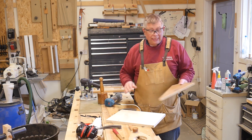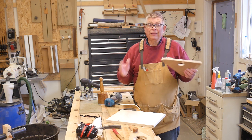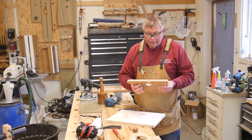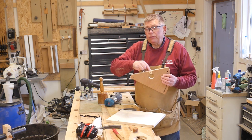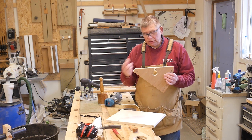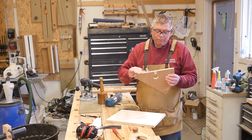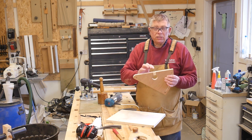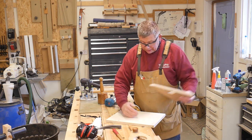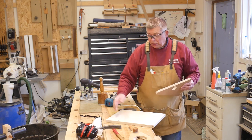The prototype that I made last week works so well there's very, very little I want to change, and nothing I've really got to change. But this is the mounting plate I made last week, and it's 16mm ply. There is a clamping hole for the drill through here, and there is a little pressure plate in there so that the collar of the drill doesn't get chewed up. That pressure plate is very, very small. So I'm going to have a bit more meat on this edge so I can put a bigger pressure pad in there. So this piece is going to be — I've used this as a template and I've added another 16mm, perhaps 5/8 of an inch, to this edge.